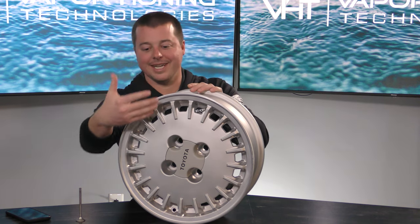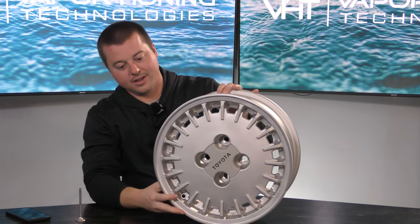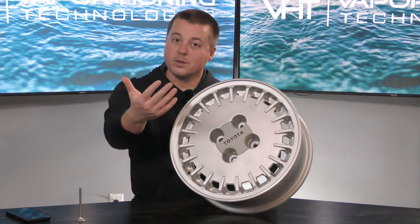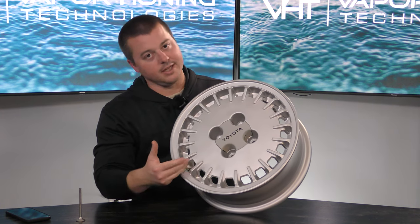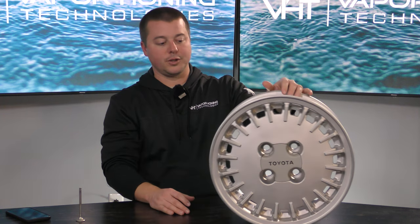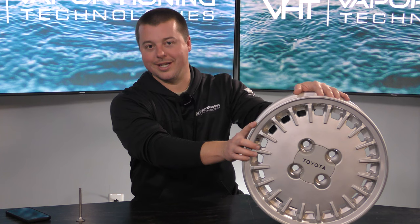It's fantastic for cleaning — way faster than traditional parts washing because you have that grit combined with the water. For remanufacturing and everyday maintenance technicians, that's what we recommend when that is the application. But I want to reiterate that you can't get a good finish with wet soda blasting. Like this right here is a beautiful finish — a great example of what most people think a wet blasting finish should look like. Soda is not going to get you there, and that's one of the downsides to wet soda.